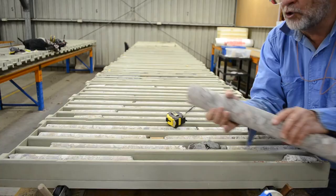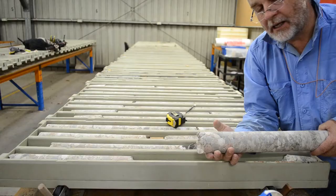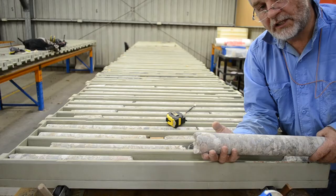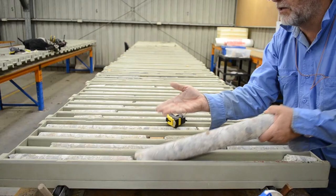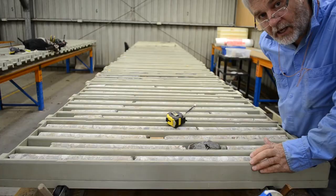The rod string spins and the core is advanced up into the inside of that spinning tube of steel — very simple really. Then at certain regular intervals the drilling is stopped, a tool is sent down the middle of the drill pipe or rod string, and the core inside is recovered. That's what gives us core that sits in trays like this.